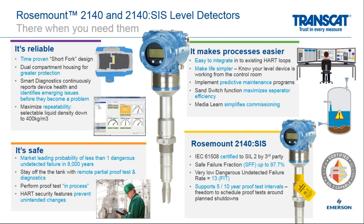Okay. And do I need special software to use the 2140? Great question. Out of the box, you don't need special software. This device is set up to be 8 to 16 milliamps right out of the box, with 8 representing dry and 16 representing wet. All the device configuration that I talked about in this presentation is above and beyond straight out of the box. If you wanted to configure it further, you certainly could. You could make adjustments to the specific gravity, do the media learn function, and set up the sand detection as well. But you certainly don't need to on a standard out of the box product.